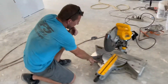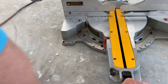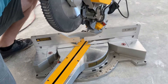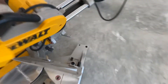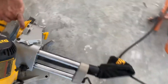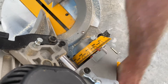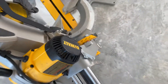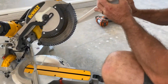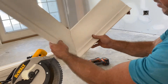If you come over here and look on the saw, most saws actually already have the numbers on there for you. So you can set the saw up before you even do any of the crazy measurements. Here's 31.6 on one side and then 33.9 for your actual bevel. So you put your miter on 31.6, your bevel on 33.9, and you cut it. When you cut it, you'll see it cuts both ways, and that gives you your compound miter.